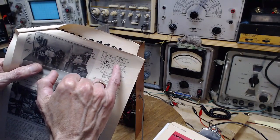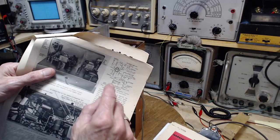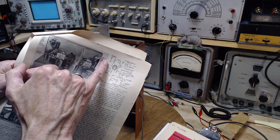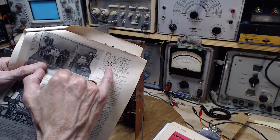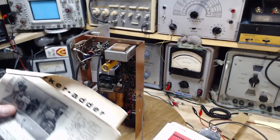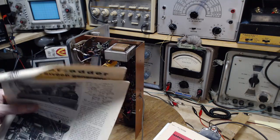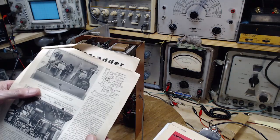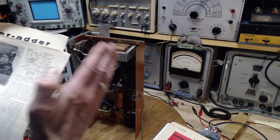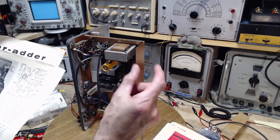There's the showing of the crystals. This is the circuit that's in here. This is not an additional circuit by any means, but he's made small changes to it. He's showing multiple crystals. What he did on his unit is he put a switch in, and he can switch through the crystals. Depending upon what kind of alignment you're doing, a video IF, audio IF, or other circuits in a television set, you can select a particular crystal, which will give you, instead of the 4.5, a different separation.